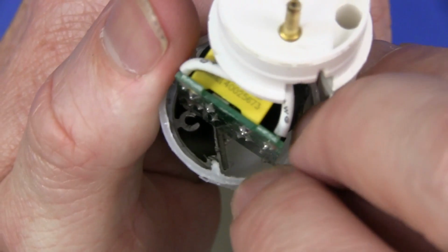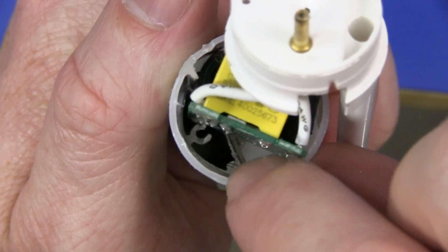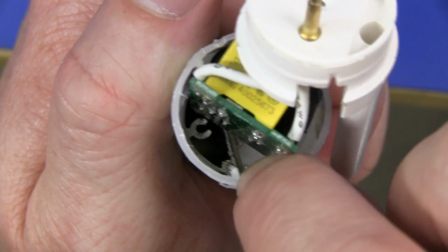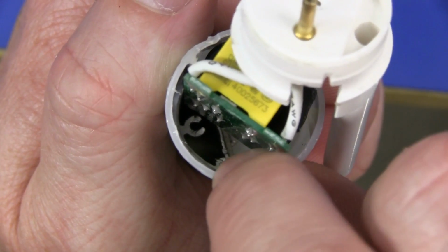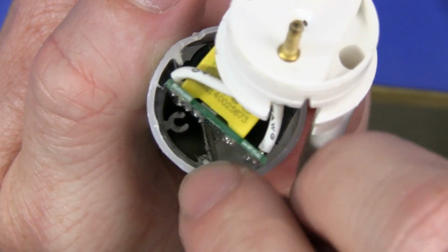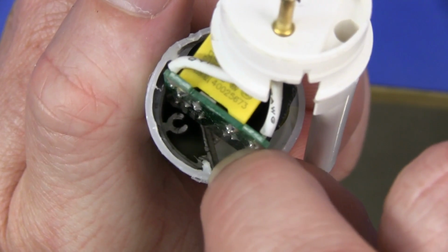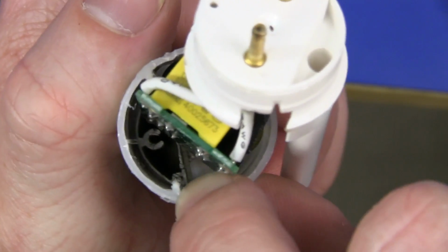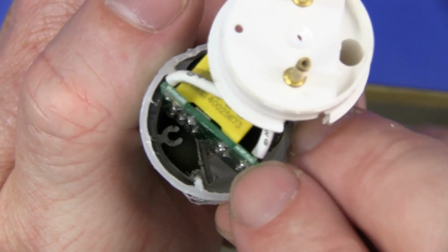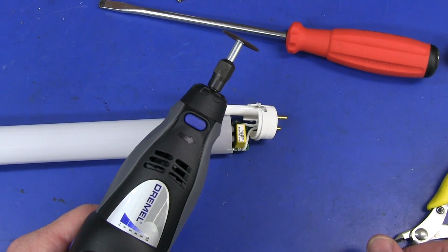Looks like a little part of the aluminium wraps around the board just down in there, so I'm not sure, but anyway, when they assemble this, they certainly slide the entire aluminium assembly in with the board. So they've got the aluminium heatsink on the back of that board. Somehow, they use some thermal adhesive on the back of that, probably to connect the board through to the heatsink there. Exposed pads on the bottom of the board, of course, solder mask removed, and then they slide the entire thing in. Found a bit of silicone on the board at the other end, but that's not really holding it. I've put a big screwdriver in there, tried to bang the whole thing out, and well, it's not budging. So when in doubt, Dremel.